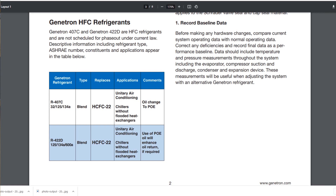It's not perfect, but it's closer to R22. There are a few differences: there could be a higher head temperature on 407c, and the suction pressure typically runs a little bit lower, which is a little scary sometimes. And here's what the document says: it says oil change to POE - we're going to talk about that in a minute.